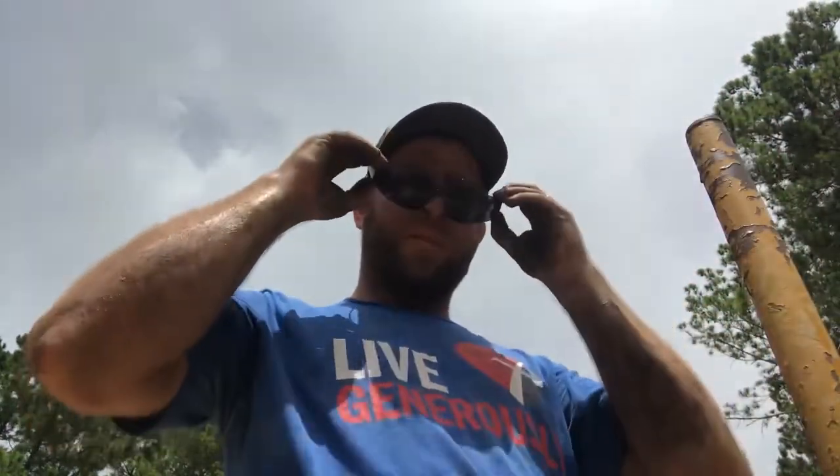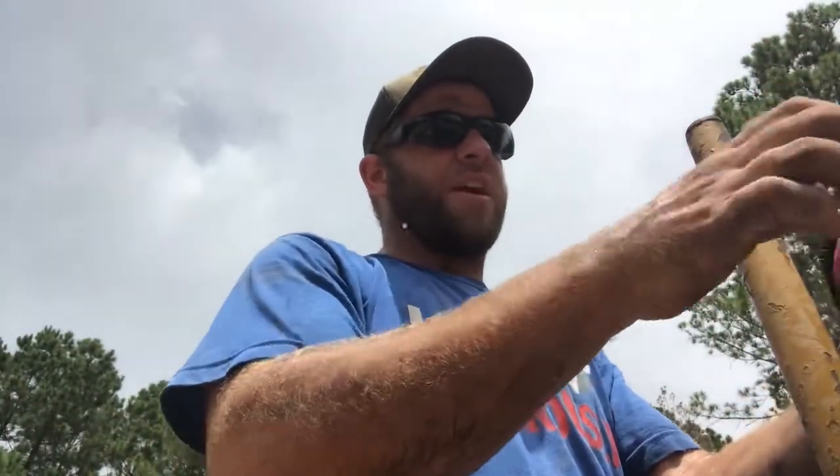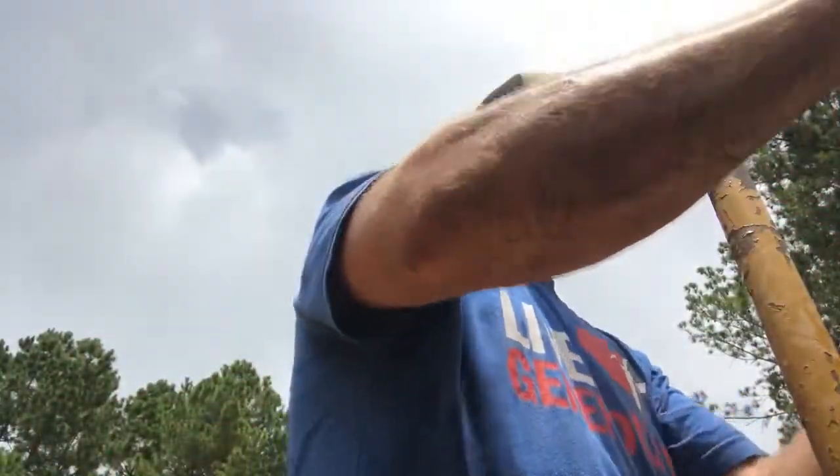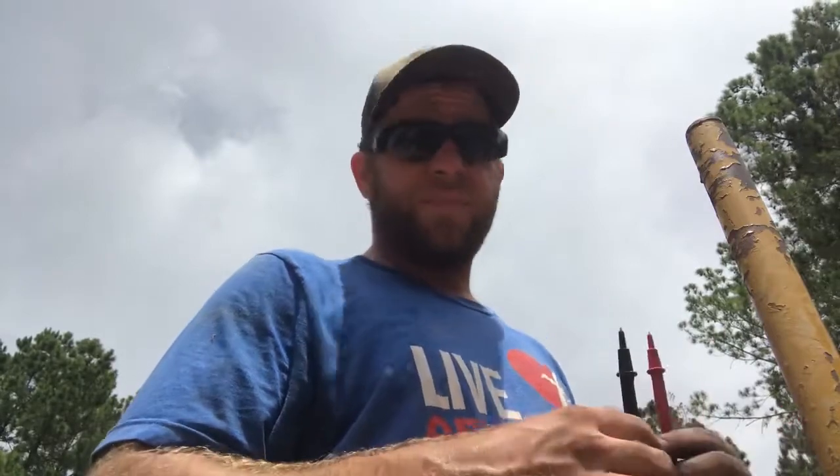It's starting to rain on me. So I put the charger on one, jumper cables on the other, got Rosie started. Thought, well, maybe I left them hooked up for a couple days and there is a short and it drained them completely down. I got the machine started, ran it for easily two hours at high rev the whole time, shut it off, disconnected the cable immediately. Came out this morning, hooked the cable up — stone dead, no click, nothing.